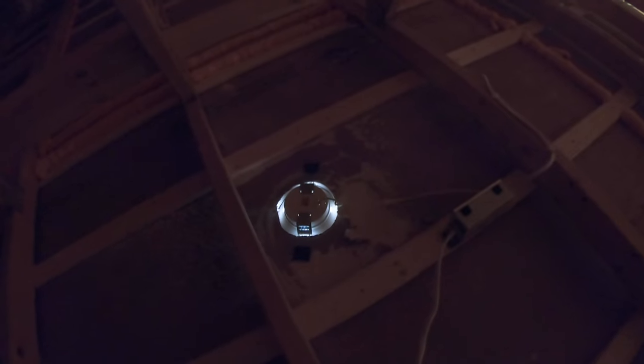But right now, really the biggest thing that we have left here today is just hitting these lights. We just need to make sure that the wires where the disconnect portion is are close enough to the light. So some of these boxes we might actually have to move and rearrange a little bit because they're a little far away. But we just need to make sure that we get that disconnect there underneath of that little cap.